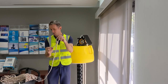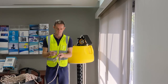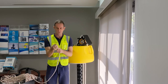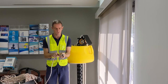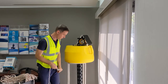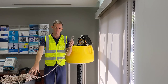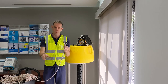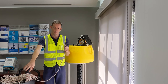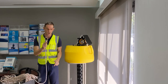To make sure the knot doesn't come loose, use a cable tie so that end cannot work its way loose over time. Then make sure it's nice and tight — that's where your D-shackle would go through to connect to the end of the chain. Similarly, at the weighted end of the bottom of your mooring line, use another thimble and shackle to connect to your chain or clump weight at the bottom. This is where a lot of wear and tear occurs, so it is highly recommended to use a thimble.